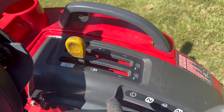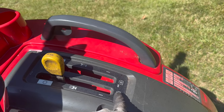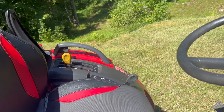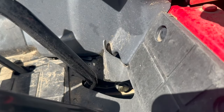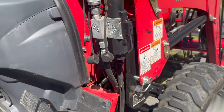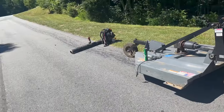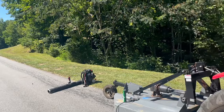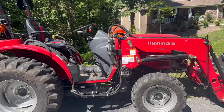As I'm driving down and getting done with that, I kind of noticed some splashing of fluid and I showed this area over here. It kind of looked like it was Armor All right here. I wiped it — it didn't look right. So I stopped the tractor and I noticed there's some sort of moisture. You may not see it because of the sun and my shadow, but there's some liquid right there. So I pulled the tractor over and stopped. And as you guys can see, there's a trail of hydraulic fluid going straight down the block. I stopped the tractor here and shut it off.